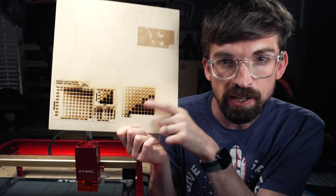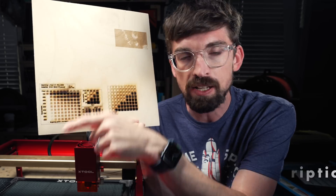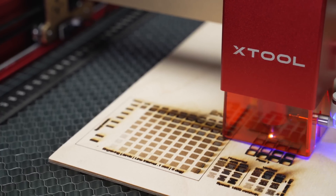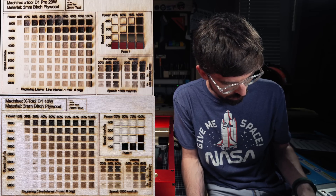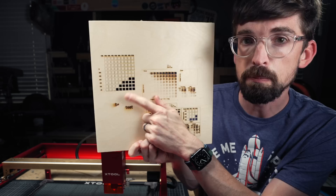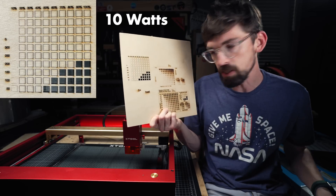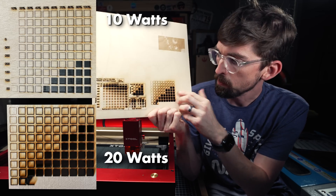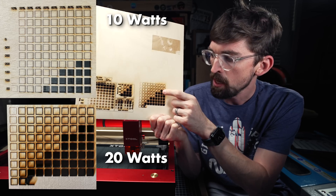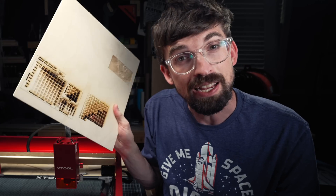Let's get into some tests. This is the test file I use on pretty much every machine I've got, and there's a link in the description if you want to use it. What I like about it is not only can you see the machine's performance, but depending on your machine and material, the right speed and power settings will be different — this helps you figure out your sweet spot. With the engraved test file you can see we're going all the way through the material at 1,000 millimeters per second at 70 up to 100 percent power. With cutting, the most obvious change versus the 10 watt is the max speed for a cut: the 10 watt maxed out at 200 millimeters per minute, while this one did 500 millimeters per minute — getting a cut in one pass through 3mm birch plywood.